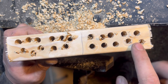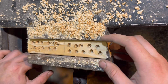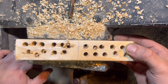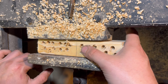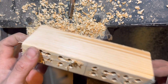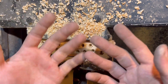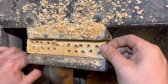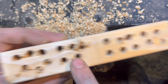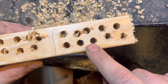One less hole but that was a hell of a lot quicker, and it looks a lot better - it felt a lot butterier going through. I was unsure at first until I went back to one sharpened on the bench grinder, and it does feel a lot quicker and more buttery. Is it that much of a difference to spend the extra time to sharpen it all the way up? No, I don't think so - going straight off the bench grinder is enough, especially if you have a handful of drill bits. But if you want really precise holes - very little chip-out compared to these, where every single one got a lot of chip-out and raised edges - a lot of these are cleaner holes.